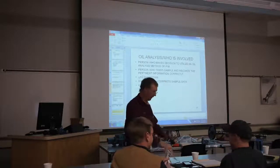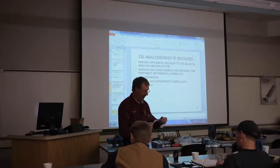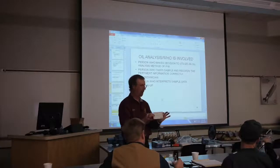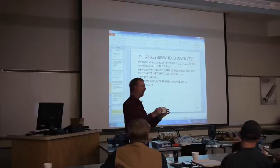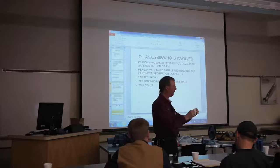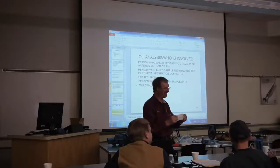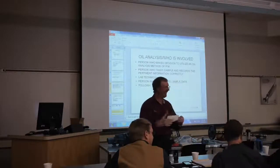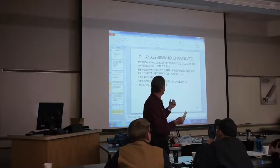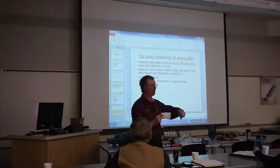The sample is right here, and there's a little paperwork on the inside. It's the SOS scheduled oil analysis form - owner, job site, sample data, equipment, meter reading, etc. If your producers do this, make sure their writing is very legible, because this information is transposed into the computer. The last slide we'll look at is an example of the readout you'd get back as the consumer.